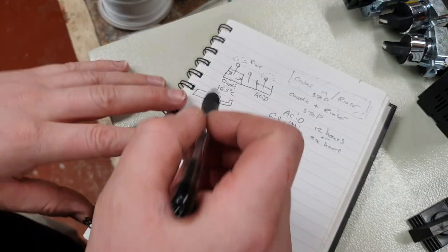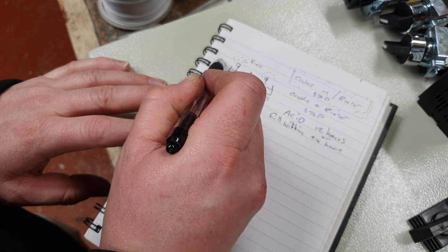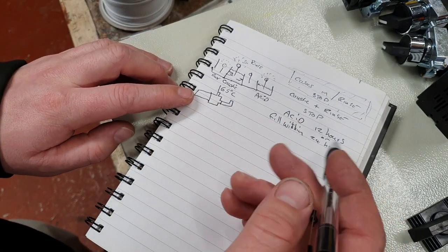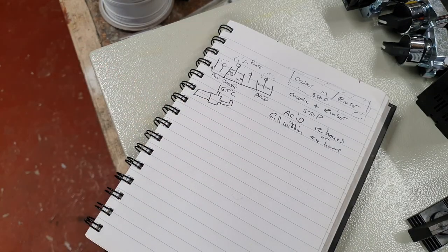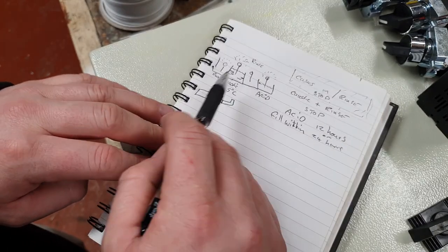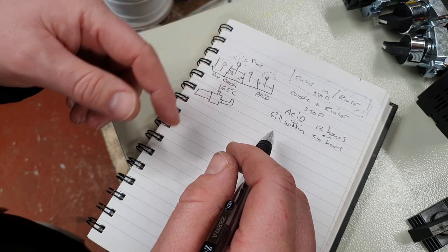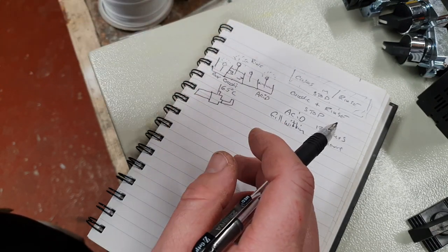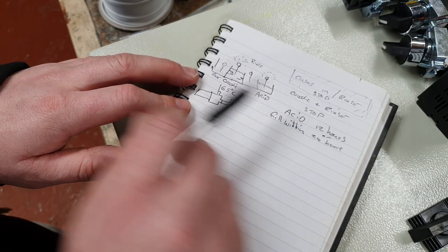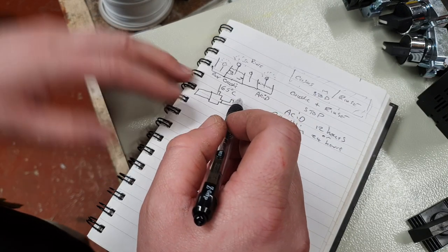What we were thinking about in the future was incorporating another rinse tank on the side, so you could go rinse, caustic, rinse, acid, fill — all in one day with no waiting time. But that's not something we're going to do with ours because the system we've got works fine. At the moment everything's manual — the pump's manual, the heater is on a thermostat so it gets up to temp on its own, but you still need to turn it on and off. We also have a drain pump for the rinse tank.